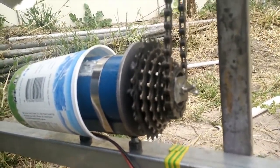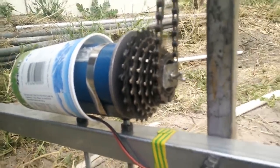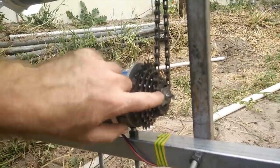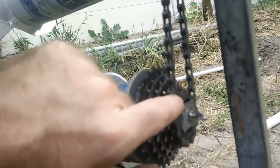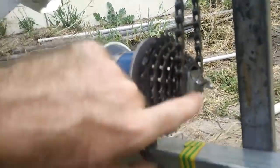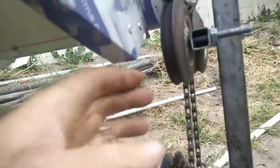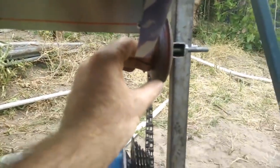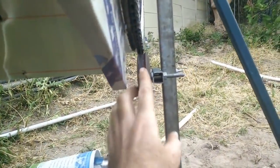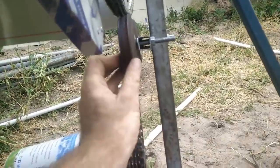Just with some nylon, like a plastic chopping board, cut with a circle saw, just as a spacer, and then just a faceplate across here. You can see I ground the rim down a bit, just so it sits in there. Bike chain, and then these are scooter wheels which I've put in a drill and essentially lathed — cut a profile into them with a wood chisel — and those are to tension the chain into the wheel.